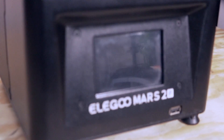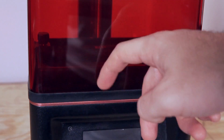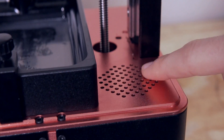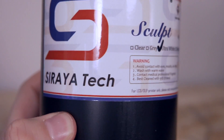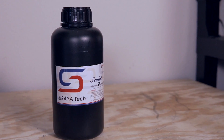As for printing, this should work with just about any MSLA printer. I'm personally going to be using the Elegoo Mars 2 Pro. I love the sandblasted build plate because things stick incredibly well, and the monochromatic LCD screen allows it to cure in just a few seconds. Since I'm using this indoors, having the built-in carbon filter is a huge plus, especially since engineer-type resins tend to have a little more odor than model resins.